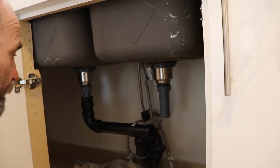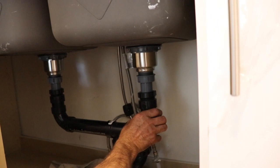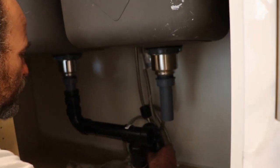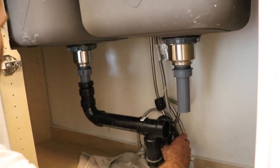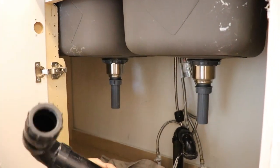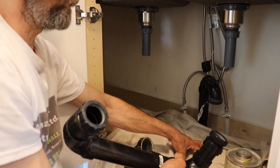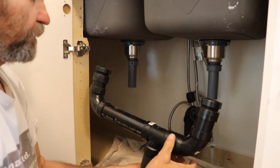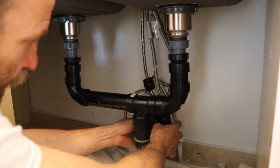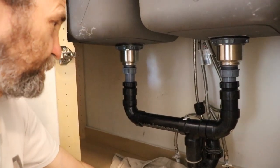This is my drain — I'm just gonna glue it together. Once you do the drain, you just have to keep in mind a few important things. Sometimes you cannot do it, but this is why we have a trap in here. You guys just make sure that you are not too tight to the bottom of the cabinet, because the reason you have the trap is that you need to be able to remove it — just move it, put it back — in case you get it clogged.